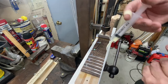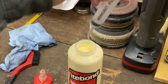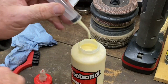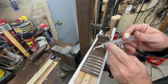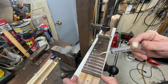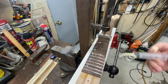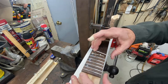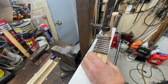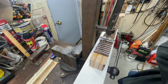I'm installing these stainless steel frets and doing something a little different — I've never glued in frets before. I'm using this Monoject 412 and sucking glue into it, just as far as the nozzle part, barely. Wipe the excess off. I'm using Titebond — just putting a dab of it in the groove. Get the fret, lower it in, and press it in.